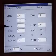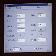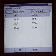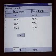On your first piece, you'll want to use 0.0 on your correct angle. You will put the appropriate length, which in this case is 3 inches. You will select your material. You have steel, stainless steel, aluminum, and other. Other is for if you're doing brass, bronze, lead, whatever other form of metals you may be bending. You can put the tensile strength in there under settings as we went through earlier. In this case, we're using steel, so I will select steel, make sure that it turns a bright blue, and hit OK.